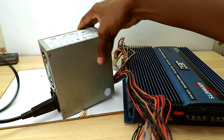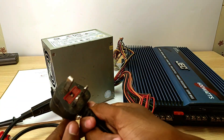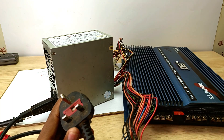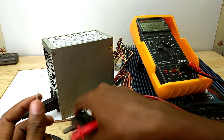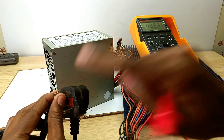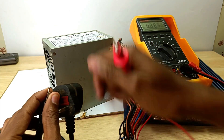First of all, always use a three-pin cable. This other pin should be connected to the chassis — a beep means it's connected. The other pin to the chassis as well. It's very important because this is exposed metal.